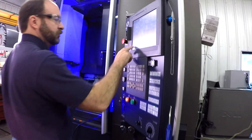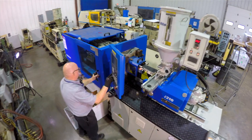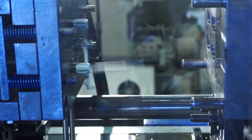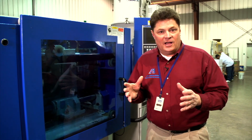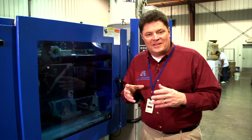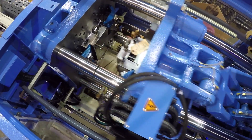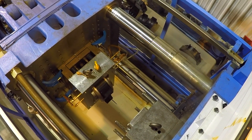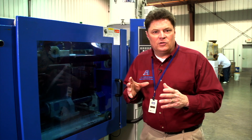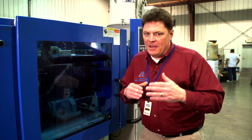Maybe you're going to spend money months or maybe years down the line, but right now you need feedback. Ash Industries is ideally suited to help you with manufacturability. How can we remove permanent costs from the part? Many times there are features in a part — maybe a hole or some features that the designer doesn't think is a big deal, but it's a tremendous expense on the tooling side. We can help work around that design if it's not required and bring the tooling costs down and still maintain design functionality. There have been cases where a customer brought us a very thick part with heavy wall sections, and by reducing the wall thicknesses we were able to not only take out costs but make the part stronger. Those very thick walls trap heat inside the part, and the longer the heat is trapped, the weaker the part is. By removing heat quickly and making those walls as thin as possible while still giving you the structural integrity you need, we can minimize cost and maximize strength.